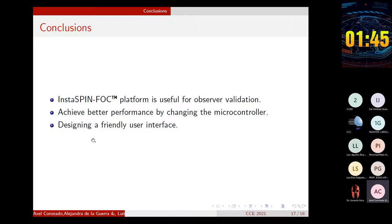In conclusion, the results of the experiments show that the experimental platform is useful for testing different estimation algorithms with an acceptable sample time. The relative error in the estimation with the CLOTE observer is less than 2% for speeds greater than 30 radians per second. In addition, it is possible to compare the magnitude and shape of the load torque, although not accurately until a torque sensor is available. We think we can achieve better performance by changing the microcontroller to use smaller sample times. One possible drawback of the InstaSPIN solution is that the microcontroller must be programmed in C in Code Composer. One way to overcome this is to generate code using MATLAB Simulink, for example, to have an easier interface for control design.